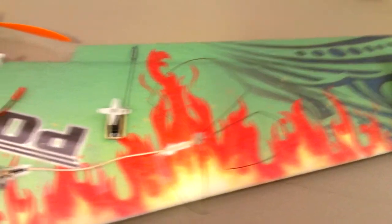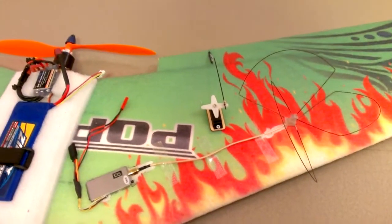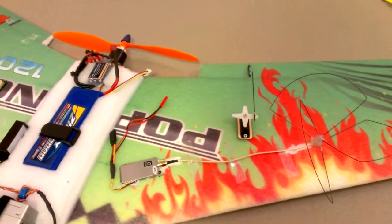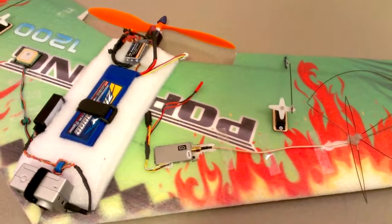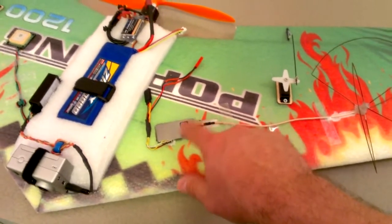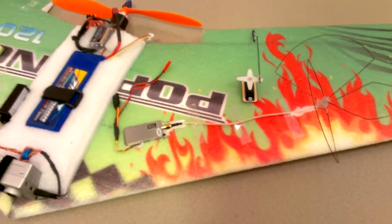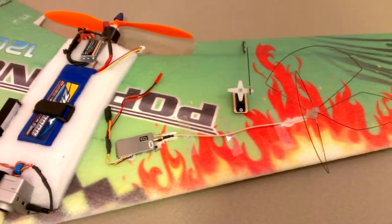I've put my 900 megahertz video system back in here. It's kind of an embarrassing story — the last couple of trips out to the field I couldn't get that 900 megahertz system to work more than a few hundred feet. I ordered a new 1.2 gigahertz system because I thought this one was junk, but I figured out the problem: the SMA connector cable had female on both sides, so there was no pin connecting the two — no active element. I feel kind of stupid about that, but it works again. I'm glad I didn't burn that transmitter up, because you're not supposed to run those without an antenna, and that's pretty much what I'd been doing.